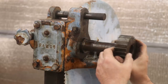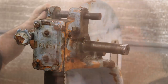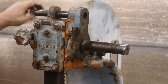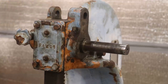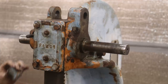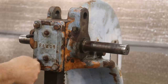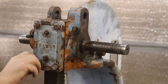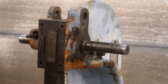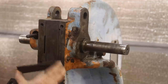Now we can come in here and take the gear off — it should just slide all the way out. I got a Woodruff key in there. This pin right here is a little locking pin that goes over in that head to keep it from coming down, and it's also what that arm rides on — it just comes right out, no problem. This is a lock and I can tell the threads are crooked on it. Let's go ahead and open this up. Looks like we just got a little adjusting piece in here — there's two bolts that go up against this little shoe.